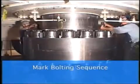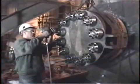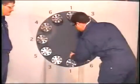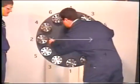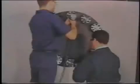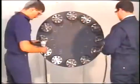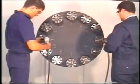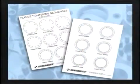Your final preparation step is to mark the stud tightening sequence to avoid confusion during tightening. For circular flanges, it is easier to follow the correct sequence if the flange is marked with duplicate numbers at 180 degrees apart. This way, both number 1 studs are tightened, then number 2, and so on. A reference sheet for marking flanges is available from Superbolt.